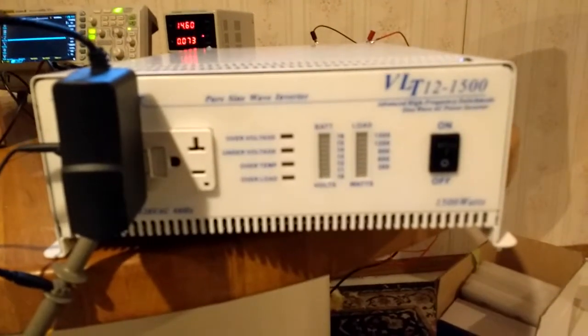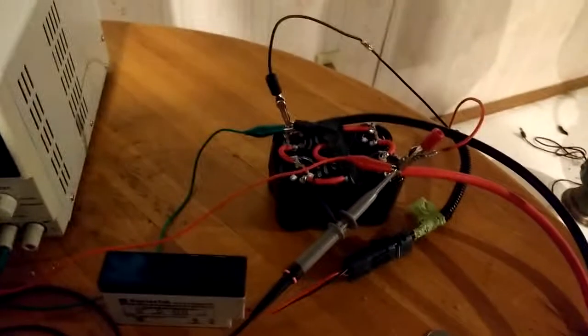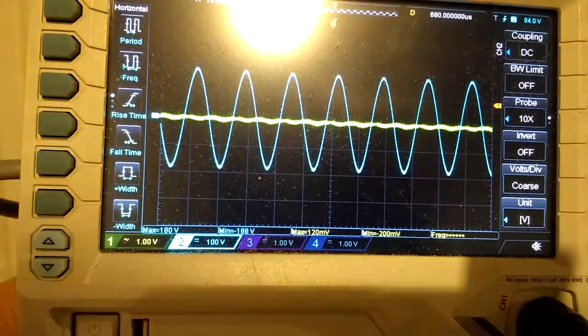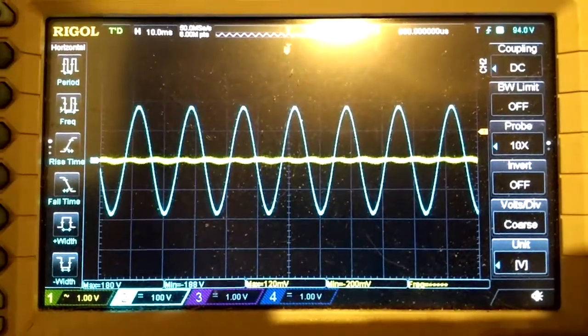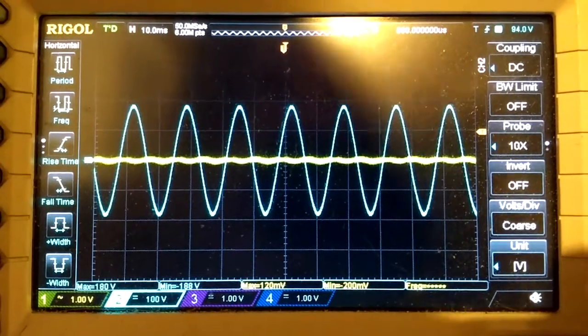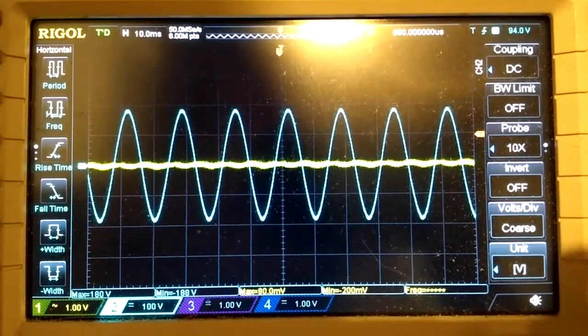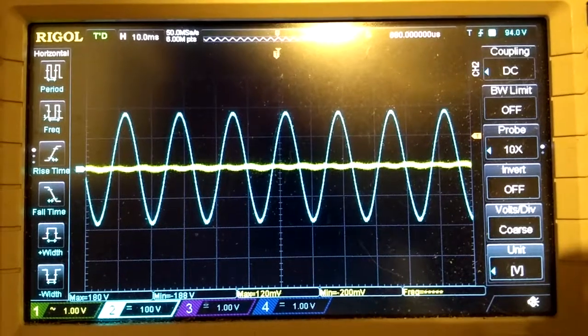But I have a new inverter and I want to see if it causes the same problem. This is my new, much more expensive inverter and I've got my probes hooked up the same — the only difference is I have them back here on the capacitor just because it's harder to probe these larger connections. I definitely see a small ripple coming across, but it's only 120 millivolts to 200 millivolts, so it will affect the DC source powering it even with this one, but you can see the difference between an expensive and cheap inverter.